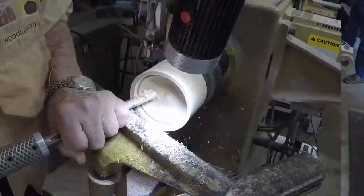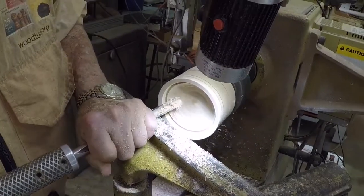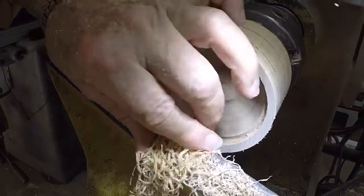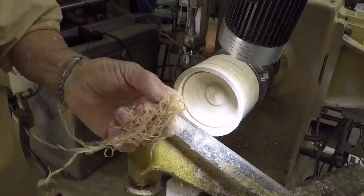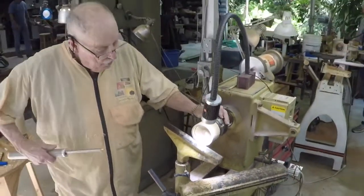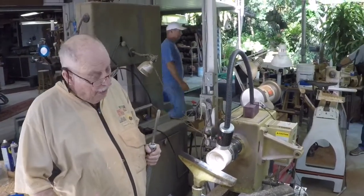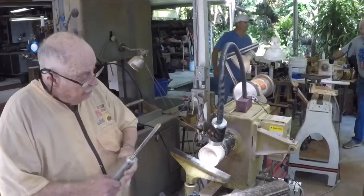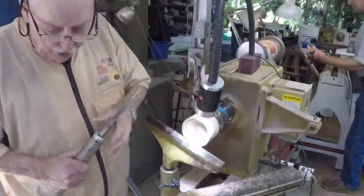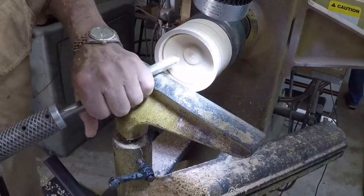That's a good tip. I'm able to ride a little bit more bevel than I was on that other tool. Now we've done away with the tear out — that's a huge improvement. What came off your bowl gouge is that kind of nice cut. When I was jamming that in there, I was moving way too fast and the tool probably wasn't as sharp as it should have been. This one's dead on. I took it out — that's good enough for sandpaper, but I'll still go ahead and get this wonk out of the middle here.